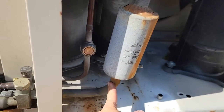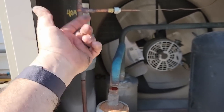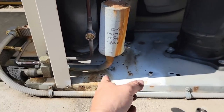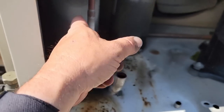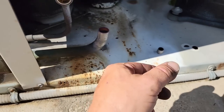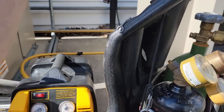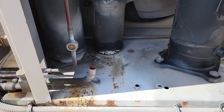Okay, we've got her cut there. I'm going to unsweat here, cut there, unsweat here, slide it up — it's easier to pull down than it is to pull up. I want a nice clean joint on the bottom. Kind of reverse logic for this one — I'm so close to that 90 that I don't want to deal with trying to remake it. Everything came apart just fine, just heated it up and pulled her out. I'll run nitrogen on the next go around. I really didn't get anything buildup-wise in there. I always carry a little brush to brush out anything that might have carboned up. Just depends — you're in a hurry, you want to try to do it right, but you've got little things that will make it simpler.